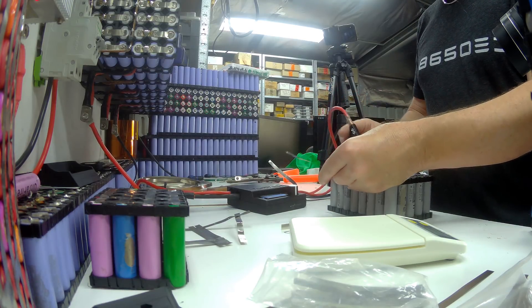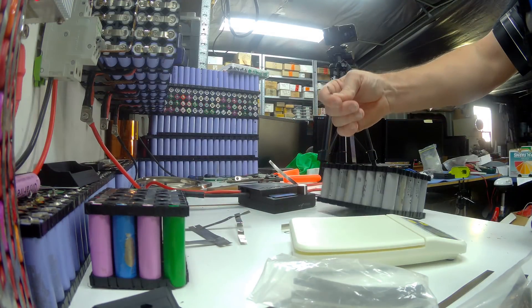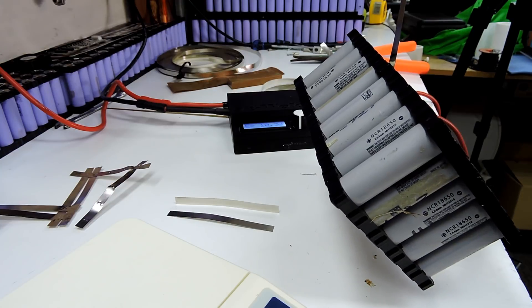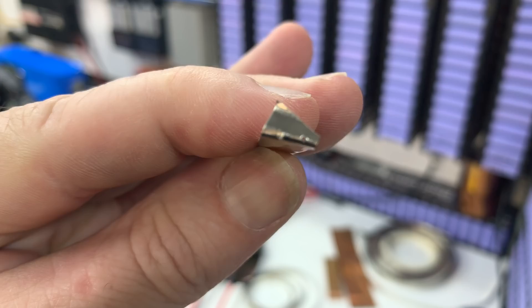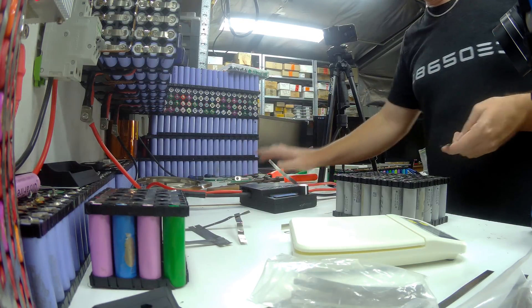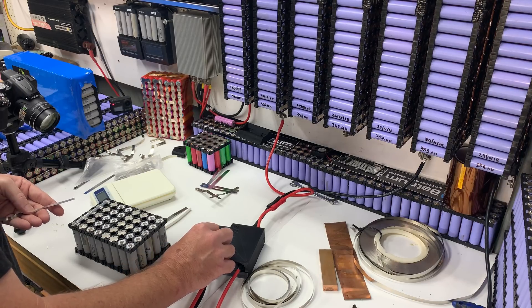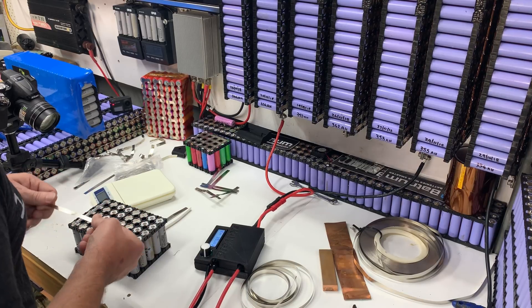Testing my nickel at 10.3 joules — picking it up nice and slowly — and that is already starting to break off. Those are the same settings I used to do the other side, so that comes off, tore the nickel a little bit, but not horrible. Going up in 0.5 increments to about 15 joules — the automatic function is very neat. That one came off pretty easily; nothing magical about that. Even pressing harder at 15 joules, it still broke straight off with no resistance at all.